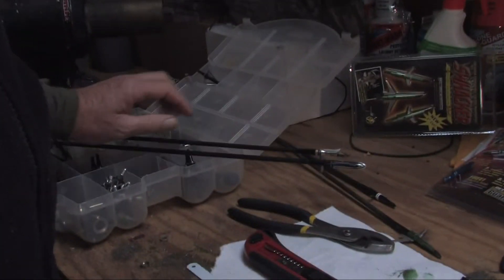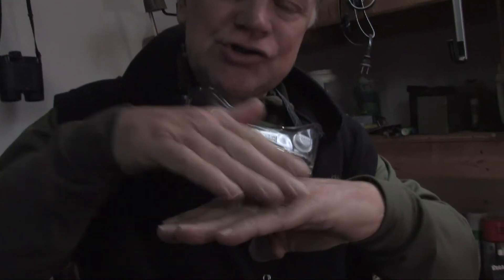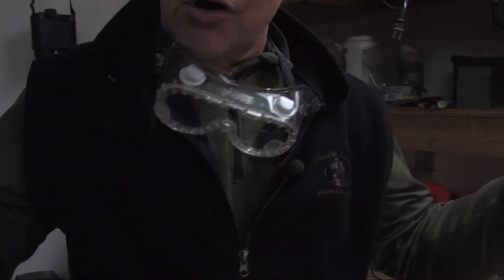Here's what that is: broadhead blades are made largely by the same process — it's called a strip grinding process. Ninety-five percent of all broadheads that you're shooting, the blades are made this way. Here's what they do: imagine a big roll of about half-inch-wide steel, rolled up like a ribbon, and they pass it through a stamping mill to stamp out the design of the blade. Then the outside edge is sharpened, and then they're on this long strip. You're familiar with something that looks just like this, done by the same process.